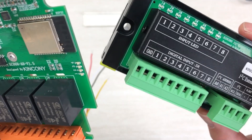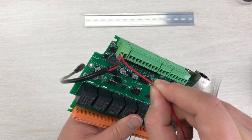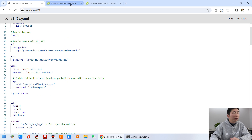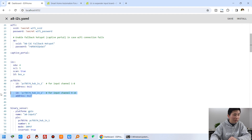I need to use this power supply - I will get it from the red 12V line and connect directly. Now let's go back to my computer and look at how to add it to the Home Assistant dashboard. I have installed ESPHome on my Windows PC for easy debugging. We can click Edit and copy the code from our forum, which has the DI8 Arduino source code and the DI8 ESPHome config YAML. You just need to change the address.